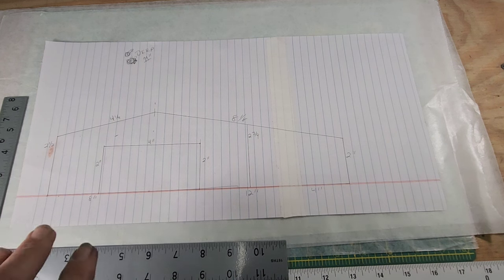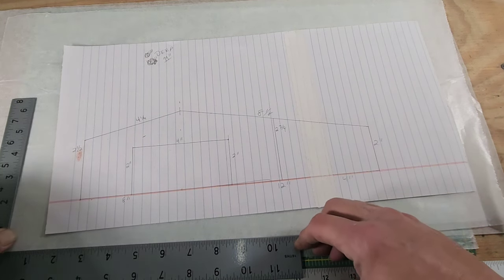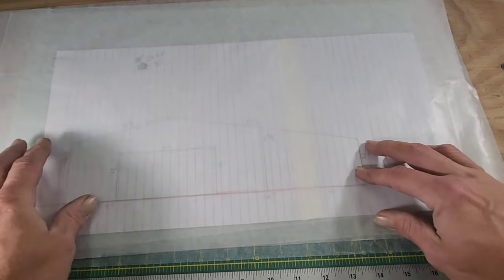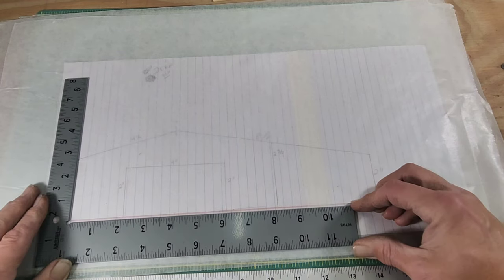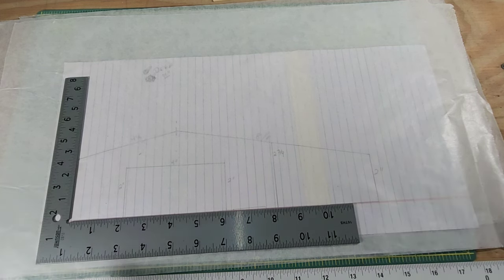I have already measured out all my pieces and pre-cut everything, so all we really need to do is glue it together — but that's still going to take a little bit of time. I'm going to do this on some wax paper. What we're going to do to cheat is put our picture underneath the wax paper so we can still see all of our lines. Then we take our square and lay it right dead on our lines because we want to make sure we keep this nice and square.